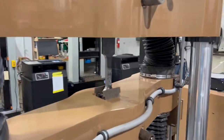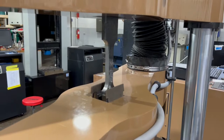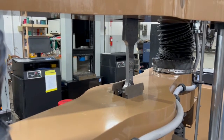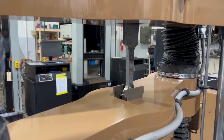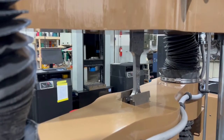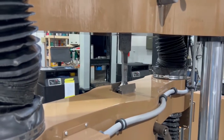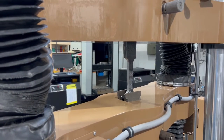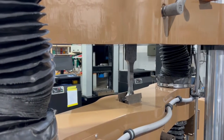From the graph I can see the specimen is starting to yield. The goal here is to see if the specimen is going to break at the weld point or in an area outside the weld. It's starting to fail — load is dropping off at about 30,000 pounds. It looks to be breaking down below the weld area.